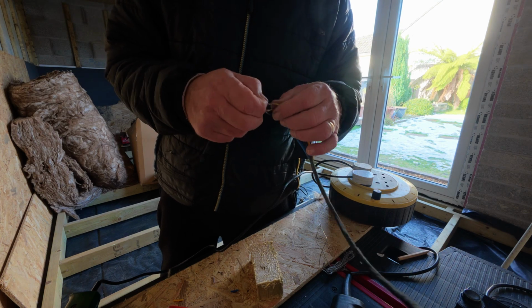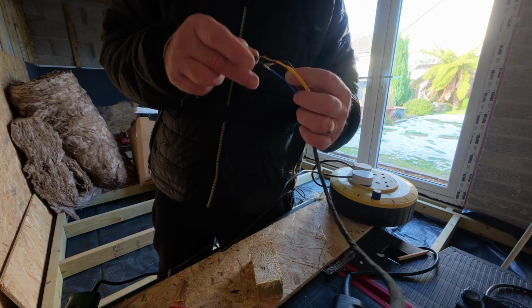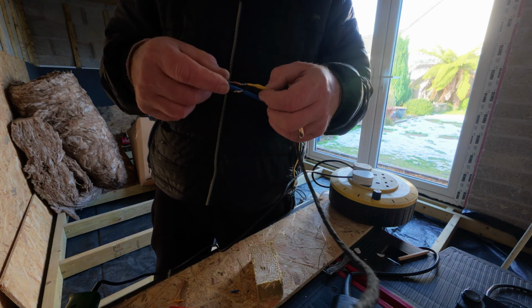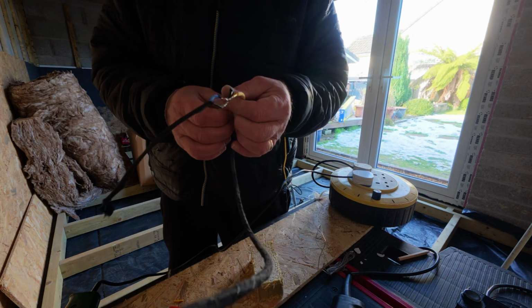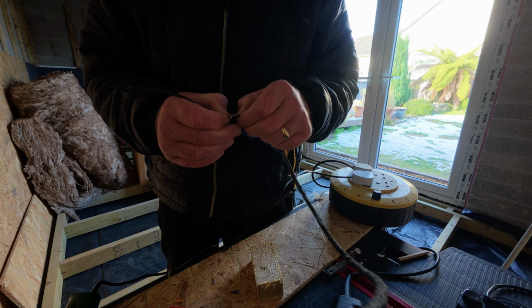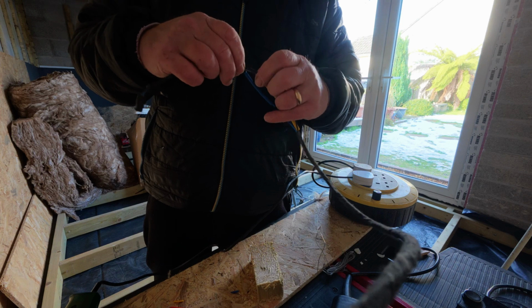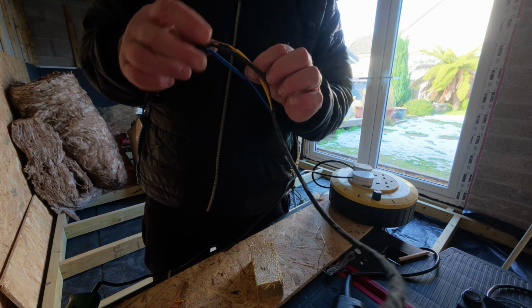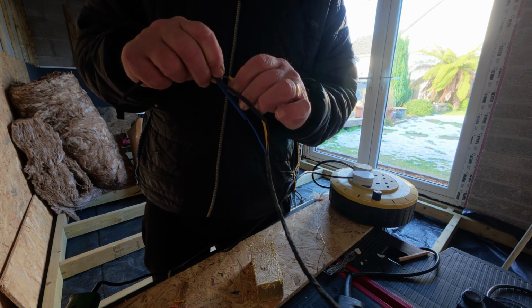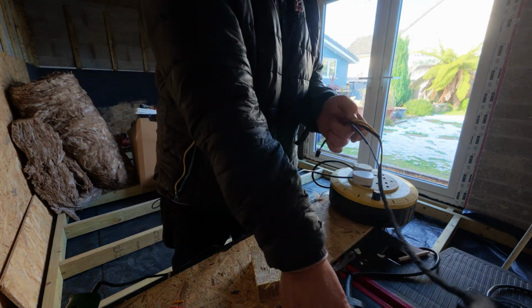These are three solders. You notice that one, the heat shrink has started shrinking there. So try and pull it away as far as you can from the actual area that's being soldered. Just get them over. It's a little bit more difficult to enclose it. You can see the yellow heat shrink is really shrunk, but with a little bit of wiggling, these over. So we pull them up nice and tight, and then same as before.